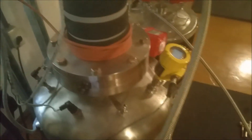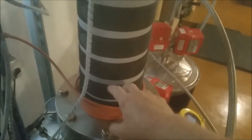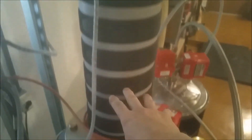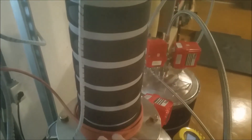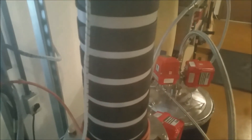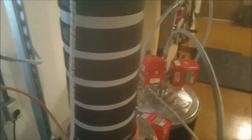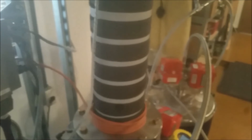If I were to pull a vacuum on the bottom to recover the solvent and it's attached to the column, it's very likely that this would go into gas phase somewhere in the area of this column, and gas we know doesn't extract as well as liquid. Try to make tea with fog — you're going to get a lower yield if you don't have the molecular density per cubic centimeter. Liquid is at the maximum density, so that allows a much more efficient extraction process.